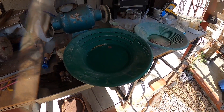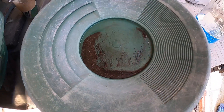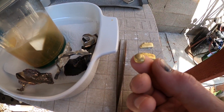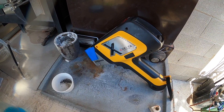Hey, this is Harry and today we're gonna turn some gold concentrates from this into this, and when we're done we're gonna use our X-Ray fluorescence (XRF) to determine what grade — usually we're somewhere around 18 to 20 karat, so that's like 75 to 80% gold, with silver and copper.